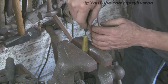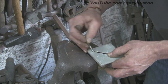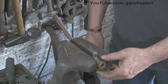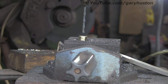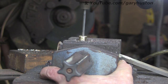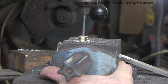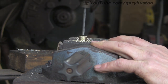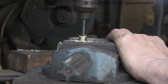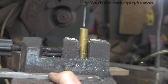Just making sure that that's about where I want it. Right, let's hope they're good enough. I'm going to put a 5mm stud in here. I think that will be about ample. I think 6mm would be a little bit too big — wouldn't leave much meat around the outside. So that's a 4.2mm drill for a 5mm tap.